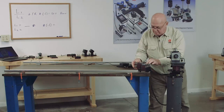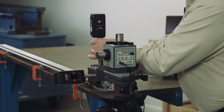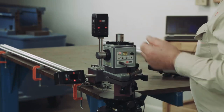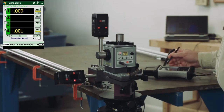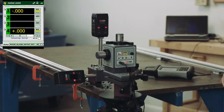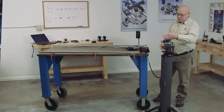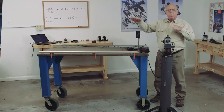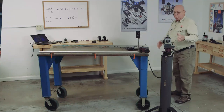Now that I have the laser level, I'm going to turn these two turrets on and get numbers on the readout. This is target number one, and this is target number four. I'm going to make these read zero. Now, because I'm going to buck this side plane in — what we call the buck-in, like what you're seeing in the two-point buck-in — I'm going to buck this plane into this rail and keep the laser level. I'm not going to buck it in the other direction because I want to adjust these rails to be level, not make it a remote situation.